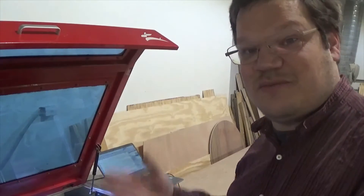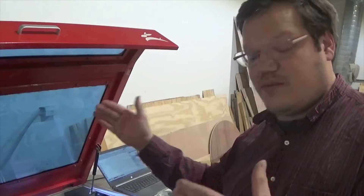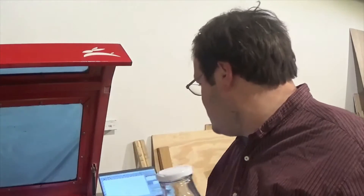Let's go ahead and get this engraved. I'm going to set the orientation back to home and go ahead and engrave this. I'm pretty upset at myself — I forgot to hit record for the time lapse of the first bottle engraving. It turned out pretty cool, but I'm going to engrave the other side of this bottle so you guys can see. Just to recap, my settings for engraving glass: 45% power on an 80-watt tube at 375 millimeters a second.